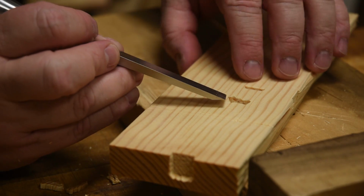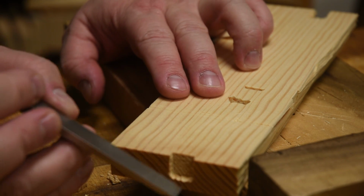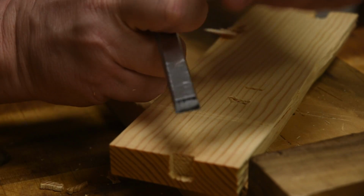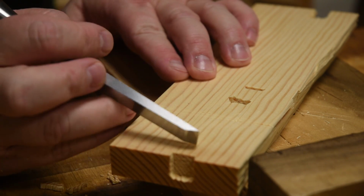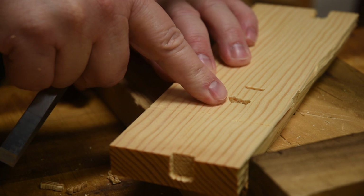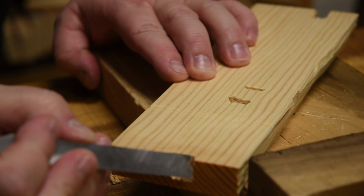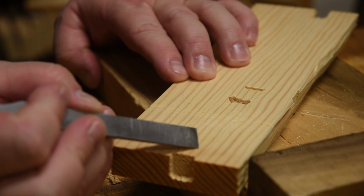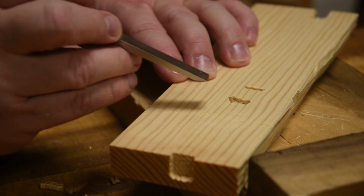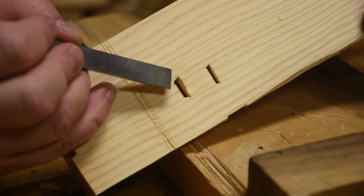But whenever we move back towards the center, because it wasn't close to the edge, so that the force of just the bevel could break it off, we had a lot of wood between here and there, it just compressed those fibers. Because in between the grains, the late growth versus the early growth is kind of soft, as we discussed earlier. So those fibers just compressed.